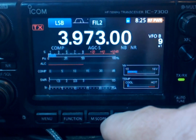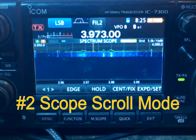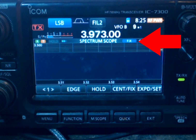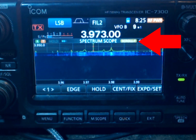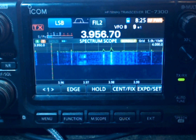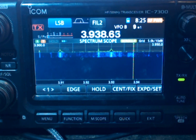The other thing is the monitor scope, and if I hold that in, you'll see I've got it set for scroll and fixed. That's what I usually like. Right now it's fixed — that's the way it normally is, and you'll see that on a lot of my videos. I use fixed mode a lot. But the scroll — let me just tap and hold — scroll, fixed. Now I'm between 3950 and 4 megahertz. So if I scroll down, I'm tuning, looking, listening for stations — you see it swaps right over. That's a big improvement.